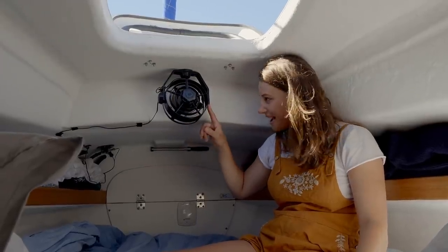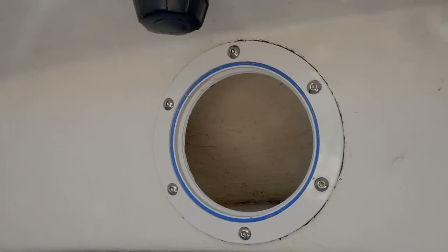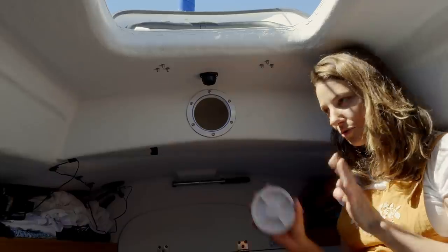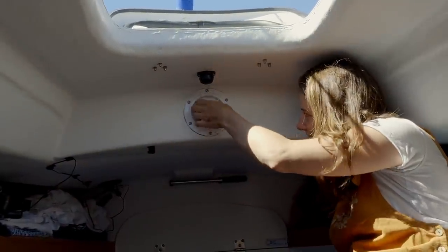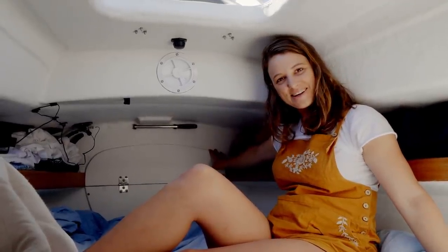There's a unique design for the Klansman — they've got a built-in dorade. So in bad weather we can shut the hatch; the venturi no longer happens, but through the dorade air is forced back through the boat. The dorade is behind the fan, which we've made removable. When we go sailing we shut it up so no water can get into our bedroom — so it's watertight. Behind me is the anchor locker.